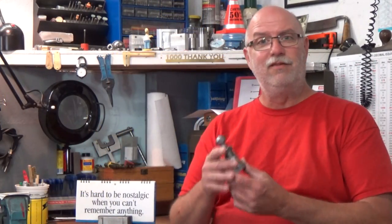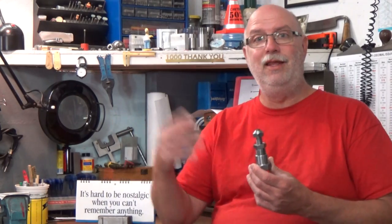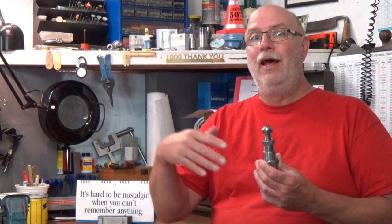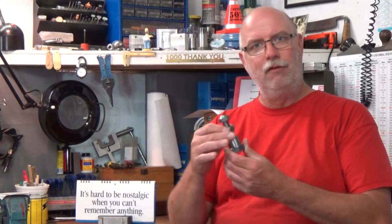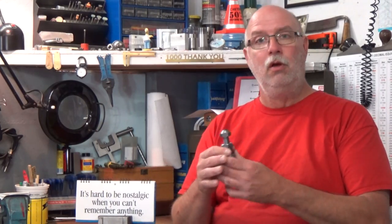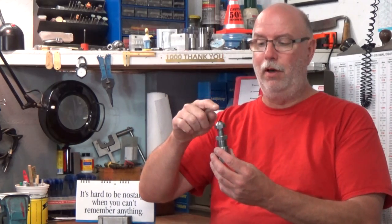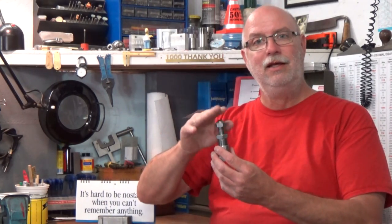I had a ball. Now, this is a great little tool, and you'll probably want to have two or three in your toolbox. They're great for leveling large parts on your mill or for supporting the end of a part that hangs out of your vise. They're very finely adjustable and they're quite sturdy. So once supported, you can even put a finger clamp on your part to hold it down against this screw jack.